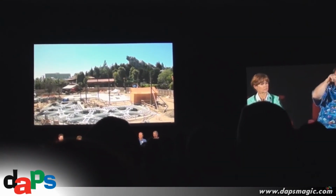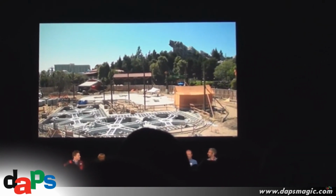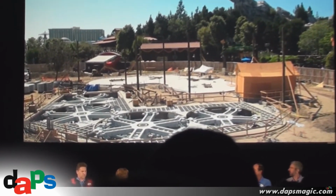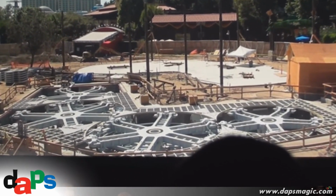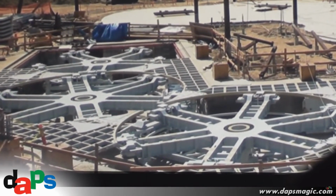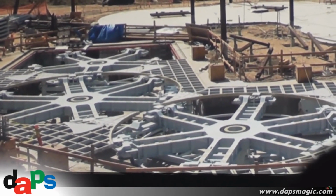Above the switching layer is the loading layer. This layer of the ride consists of four large turntable spoke structures that rotate during the ride. The two outer turntable structures feature five spokes, while the two inner structures feature six. This ensures that there is always one empty space in front of each vehicle for the vehicle ahead of riders to occupy. Each spoke of the structure has two large I-beams that reach out from the center to where each